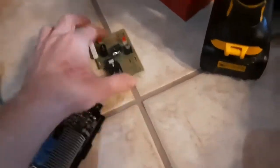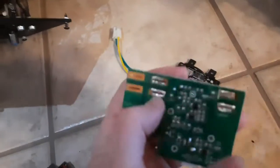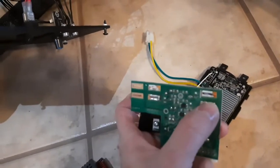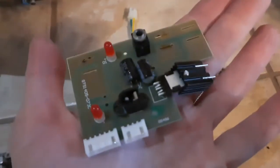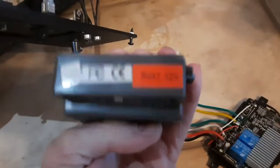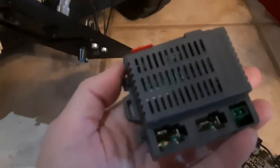So here's what I did — I pulled this out, pulled this out, which I desoldered here and here where the on/off power switch is, and whatever amp is on there for the headphone jack. It wasn't very loud, didn't sound good, tiny speakers might have been part of it, but it sounds pretty good now. I got a generic Power Wheels remote control receiver, the RX-43, for 12-volt. Got it all wired up — I'll post the wiring diagram.